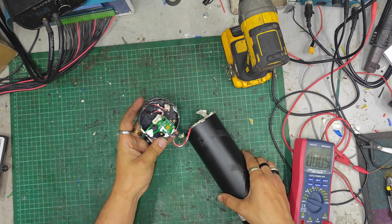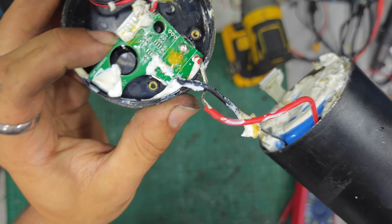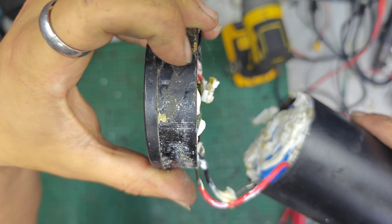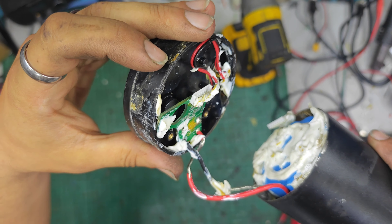The biggest problem is the board, where it was all glued on, has cracked. As I was pulling this off there's resistance and resistance, and it comes out over a centimeter before you can even see what's happening inside. We've also got a little hall sensor down there on three legs off the back of this part that seems to detect when it's on the bike. I'm not sure if I'm going to be able to repair this damaged board or not, but I'll have to have a go. I suspect that these ports no longer connect and that the board is damaged.